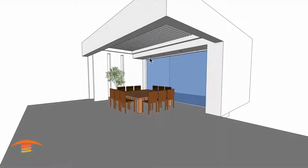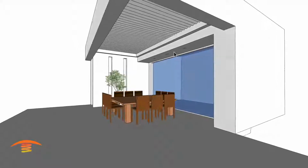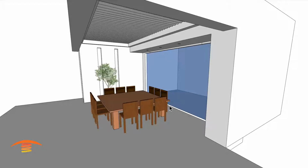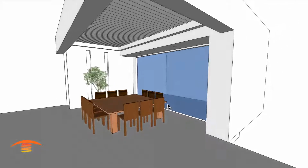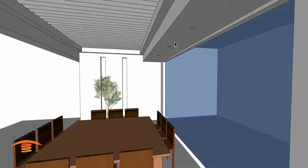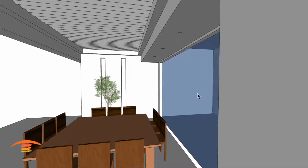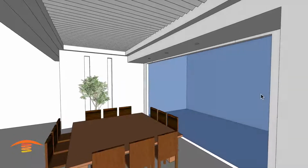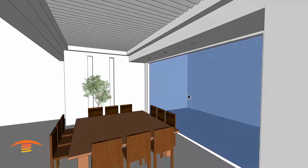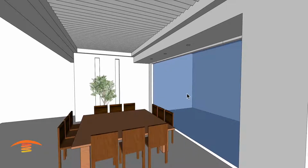Customer did ask about placing heaters underneath here, and while that might be okay for just this outside or the inside area here, it won't heat up the whole patio. And again, speaking about the glass, the only way you can really physically do something like that is to angle the heater out. You don't want the ray to be too close to a glass surface, because you'll have a level of the glass where the ray will penetrate and superheat the glass, so there'll be a top section of the glass being cold and the bottom section being hot, and that could potentially crack the glass. So you want to be careful about how close you go to a glass surface, even though the glass is non-combustible, quote unquote.